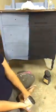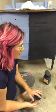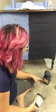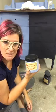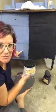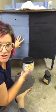Okay. So this little dresser right here is super cute. What you're going to need for this is obviously the paint that you want. To wet distress, you obviously need layers to distress. So what I picked for this piece is the base coat, Blueberry by Dixie Belle, and that is one coat. It's kind of crazy because the coverage on it is unreal.